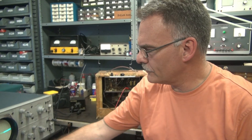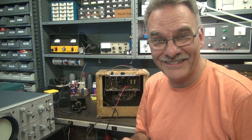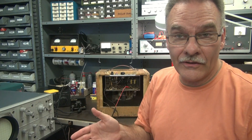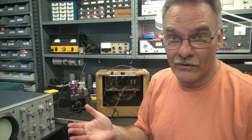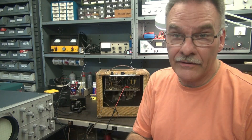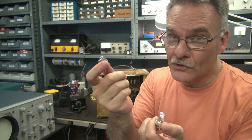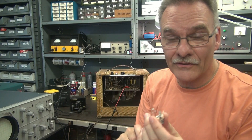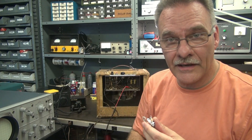Giving the HP a little rest — that thing generates a lot of noise, but it is pretty cool. I love that old gear. I talked to the owner and explained the issue. He would like it if I could have maintained those old original jacks, but they're just way too far gone. What I have here is a couple of new Switchcraft-type jacks, built just like they did back in the day — they won't be 50 years old, but they'll fix the problem. I'm going to install these, fix the solder connections, and then check the amp again.